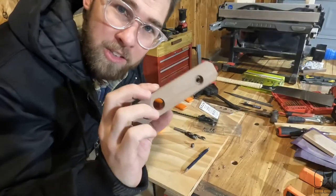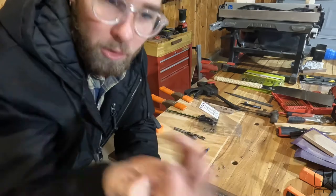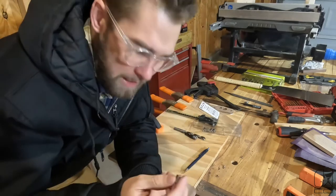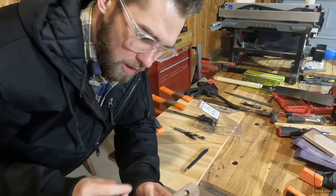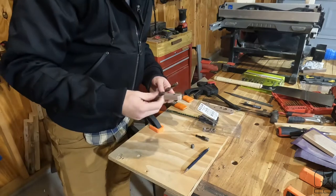The wooden one, I don't have the same metal standoff to be able to attach a tripod. I'm going to install this threaded insert, quarter 20 threads on the inside and like a knife edge thread on the outside. I've used these a lot in past projects. I found the ones that have the knife edge work really well, especially in the hardwood. I got a set here that has an installation tool and then the exact size drill bit. I'm gonna just go for it.